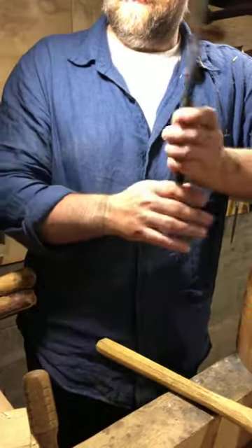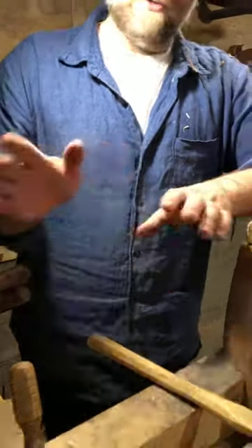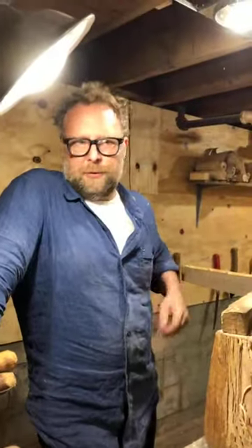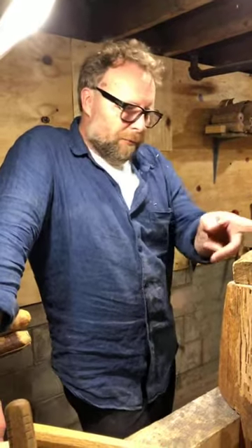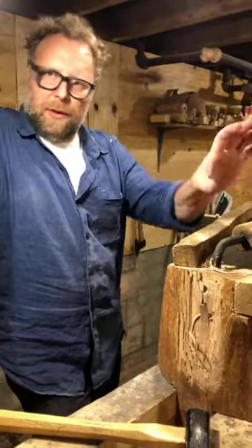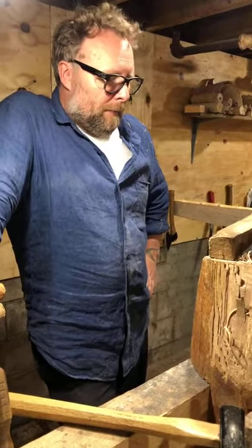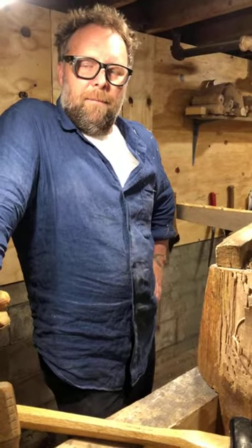He said cool thanks — I have a tool with no taper but it also has no back bend. Yeah, that was the issue. Back bends are very important — not much, no more than a quarter inch. You can always move your pivot point or tool rest to make accommodations. Signing off — see you later. Visit our website woodspirithandcraft.com if you wish. Thanks everybody, we'll see you in a bit.